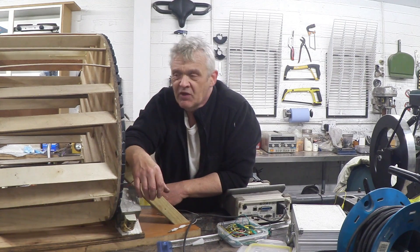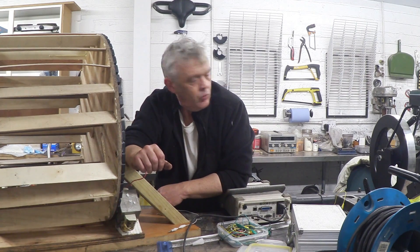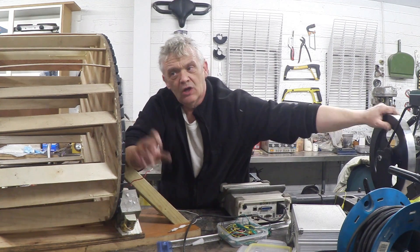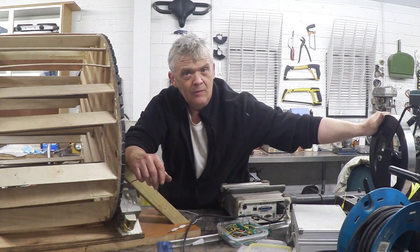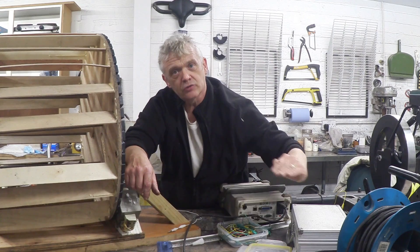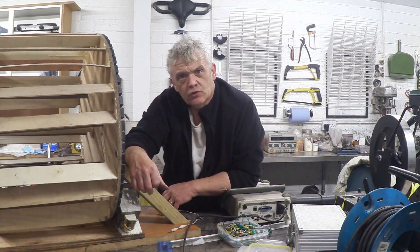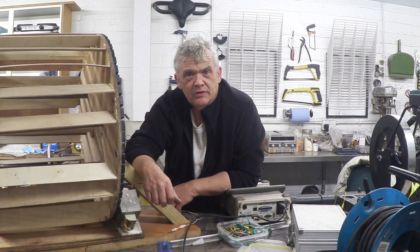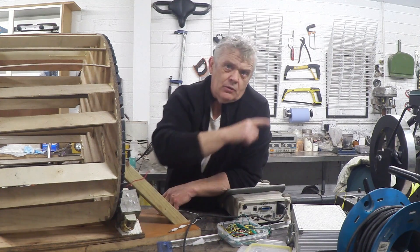It tells me to stay with this design. The cable drum was used because it was available, but that warping is a serious drawback, which is why I was going to bolt it to the machine here — because this machine is true. If I bolt this wobbly old drum onto that, the drum will wobble but the whole machine won't. And where we put the magnets on that flywheel, that's going to run true, so we can keep this coil close to the magnets and get a constant output. We could also reconstruct this using a nice flat piece of material — resin, aluminium, something like that — where we can stick the magnets on. It was a really good suggestion by John because it's very simple, and simple is always best.